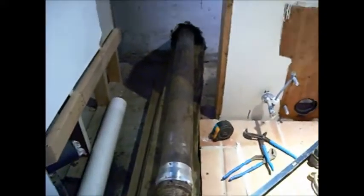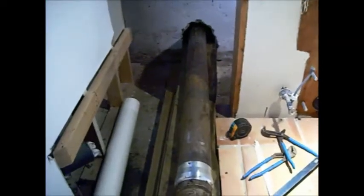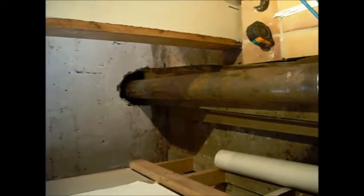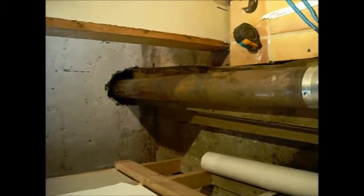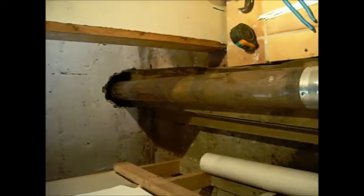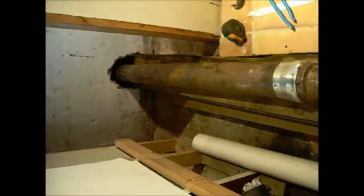I'm Tim with Hydro Plumbing, Utility Supervisor. We are prepped and set up for a sewer repair. We are going to directional bore from an interior basement through the block wall. We're going to renew the sewer out into the middle of the yard. Her sewer waste line is currently broken under her porch — a finished enclosed porch that cannot be accessed. We're going to directional bore and sleeve a new line under the porch, reconnect her sewer to the outside, and then make the new connections inside.